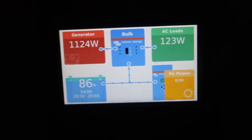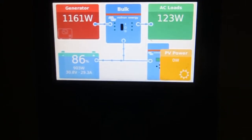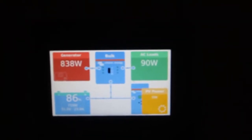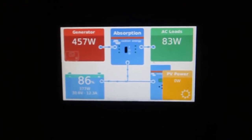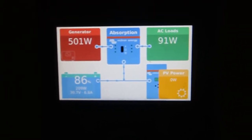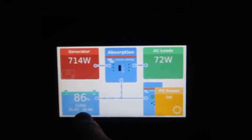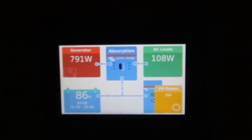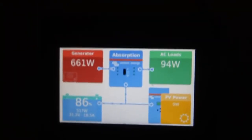27, 29, 30 volts charging. What's the story — why is the relay not clicking out? 31 and a half, absorption. The battery is getting full. Those batteries are disconnected now because the relay is off, as you can see. So I'll turn off the camera — it's not going to be interesting to watch the machine.